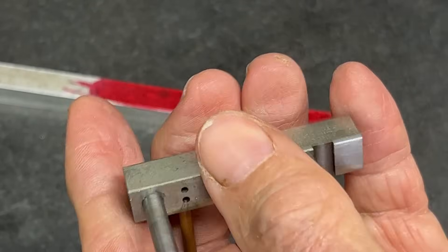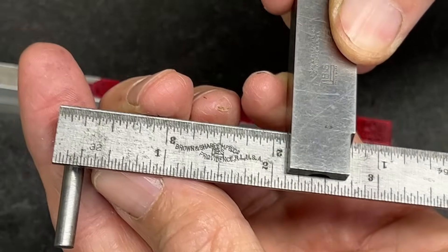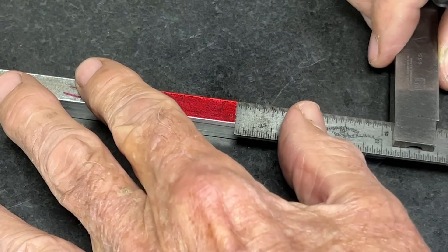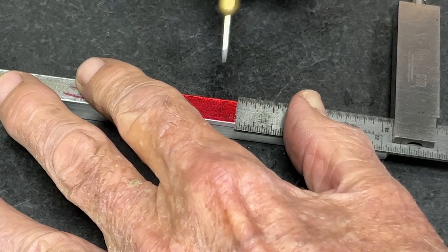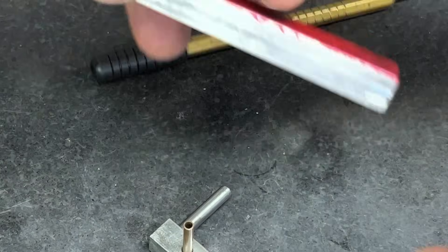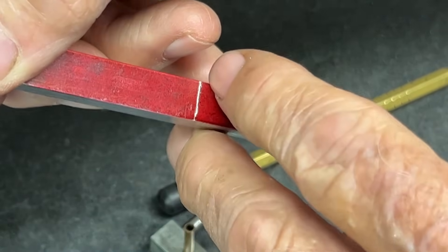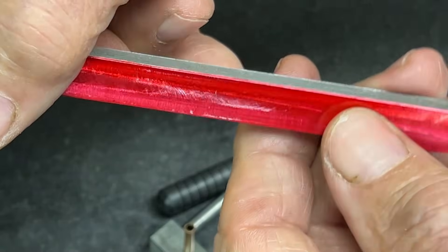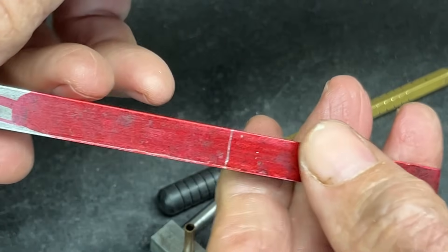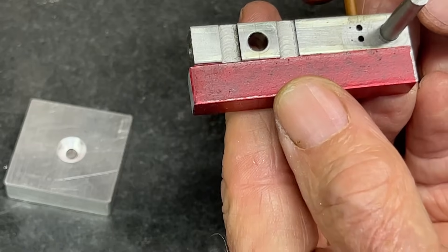Here's the original column, and that's exactly two and one-eighth inches long. So I will proceed to lay out the magnesium here. There's the mark — I'll go saw it off and sand it flat and square, like I did on that end. No need to face it on the lathe, although one certainly could. All right, it's cut off to length.